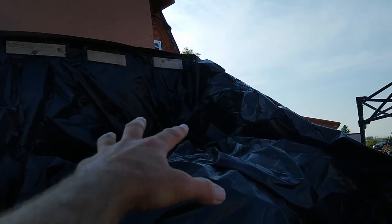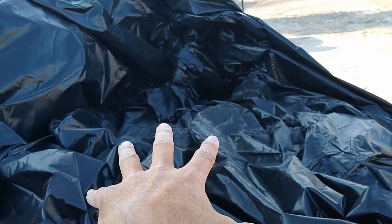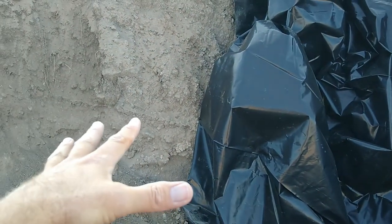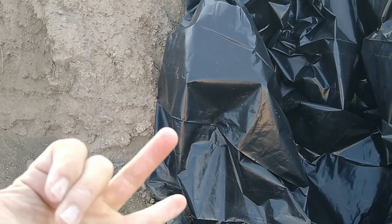When I go to dump dirt now, those pockets already have the plastic tucked in them and I have plenty of extra plastic up here. So as I'm pouring dirt and it tries to pull the plastic down, there'll be spare plastic and it won't be putting so much tension on it that it rips out. I'm going to start pouring up here with the tractor bucket first, then make sure the plastic is okay and dump it down here. I can also pull up more plastic from the bottom if needed.